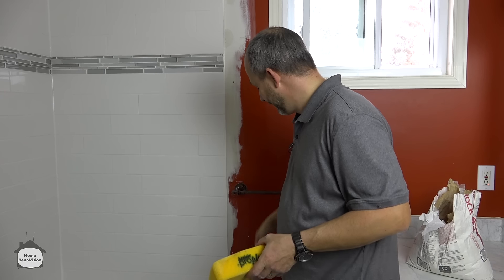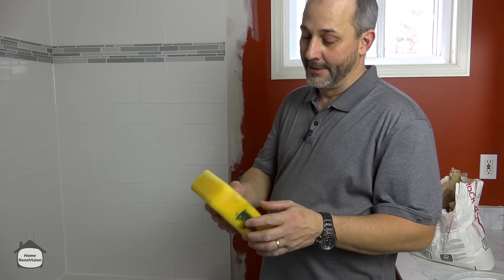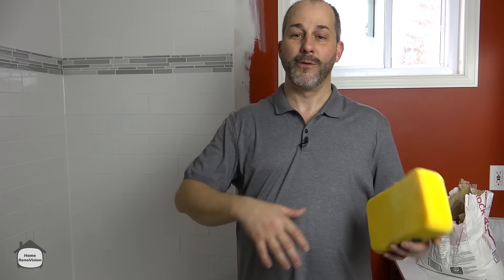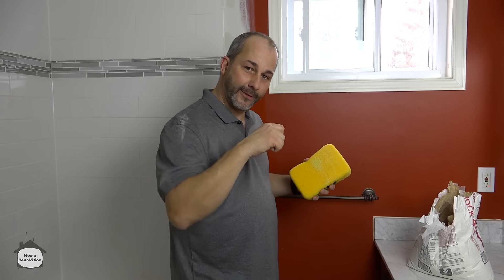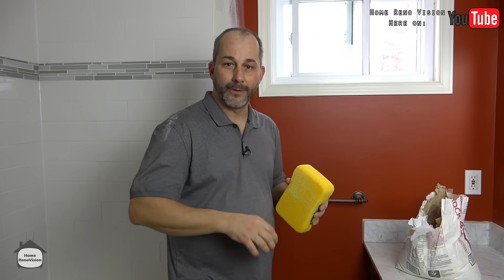The best thing about this 45-minute mud is that even after you get it wet, because it has a hardener, it'll dry in just a couple minutes. So if you want to get a job done in the same day, you can take a whole room, do all your patching, and you don't have any priming to do. Or if you bump a wall with your ladder on the way out, do your 45-minute mud, put it on quick, give it a few minutes, even take a hair dryer to help dry it off, then a damp sponge. Come back with some paint, get a little mini roller, and you can touch up your paint job and walk out the door within the hour. That is money in the bank.